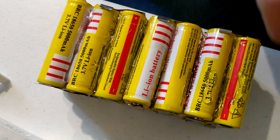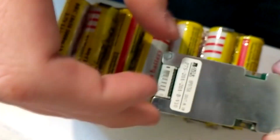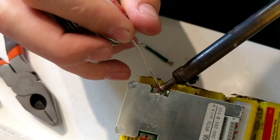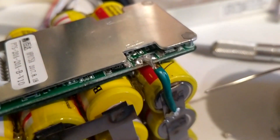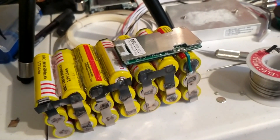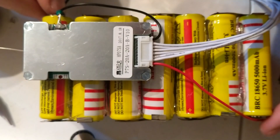For this I used more hot glue, which so far has held it on just fine. The next thing I needed to do was attach the negative terminal of my battery pack to the terminal on the side of the battery management system. This is what will shut it off before it gets too low of a voltage. As you can see here, it just literally runs straight from the negative of the battery pack into the battery management system, and then the post on the other side is where the negative from the system comes in.